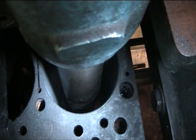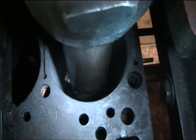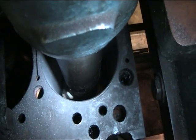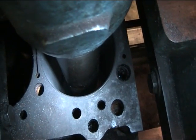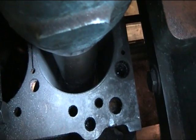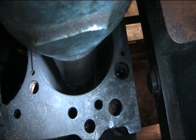Two inches sharp, nice and even — about maybe an inch and a half away from the bottom of the bore. When the cutting tool reaches the bottom of the bore the machine senses it and will click itself off into neutral at that point, engage the motor, and return the bar back up to another cut if needed.